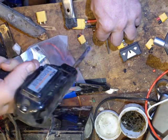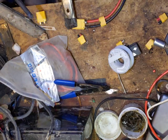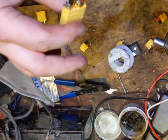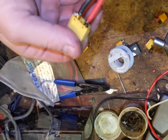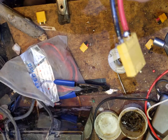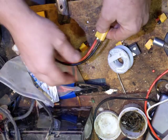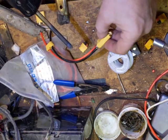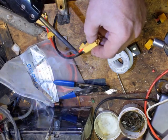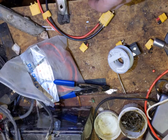I used a Weller for a long time but I found the tip kept losing conductivity and it was impossible to put any pressure without bending the tip. This is a solid tip — it's not going anywhere. So now we've got a good mechanical bond. It's not my most perfect work, but you want to make sure if you're going to use a cap like this, because it's recessed, that there's room around that. So now we're going to clean that up a little bit — remember the solder melts at a low temperature. We're just going to scrape off the extra solder.